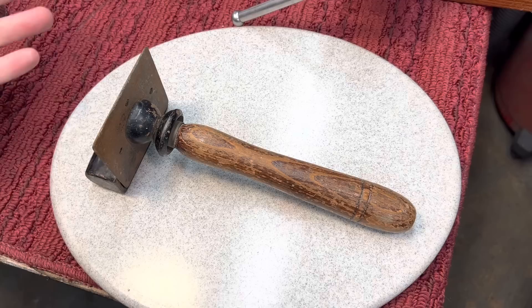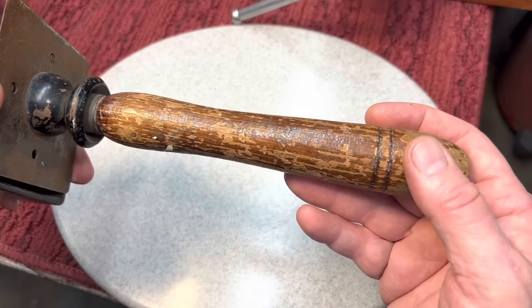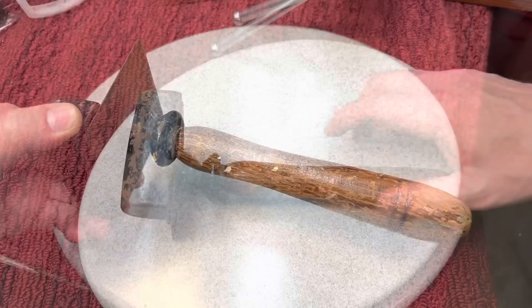Scrapers were big years ago. Scraping is much preferred to sanding. It's easier, leaves a better finish, a smoother finish. Scraping is what you use to take off old finishes. And it's funny because we're going to have to use a scraping method to clean this varnish. You could see this is typical varnish failing — it starts to crack and then it flakes off. That's a typical varnish failure, but we're going to be scraping that off.